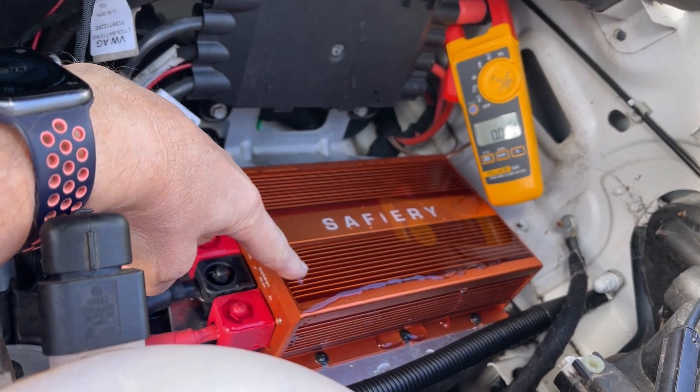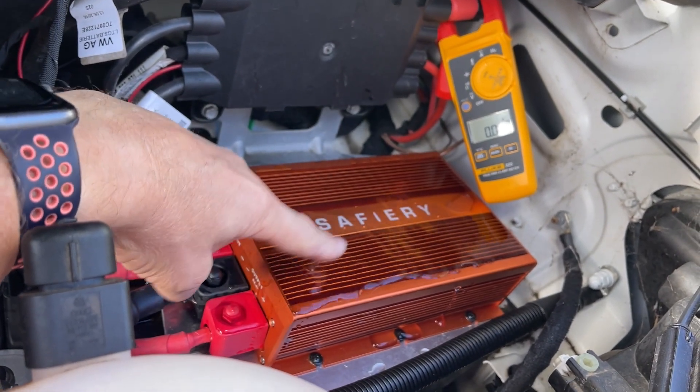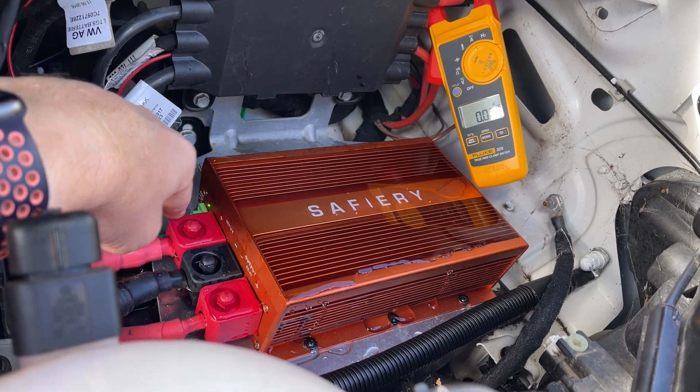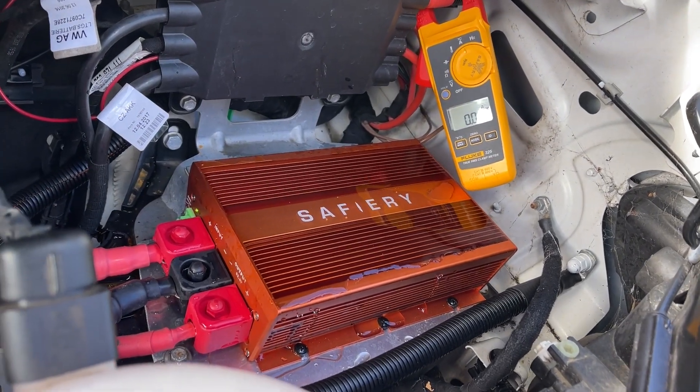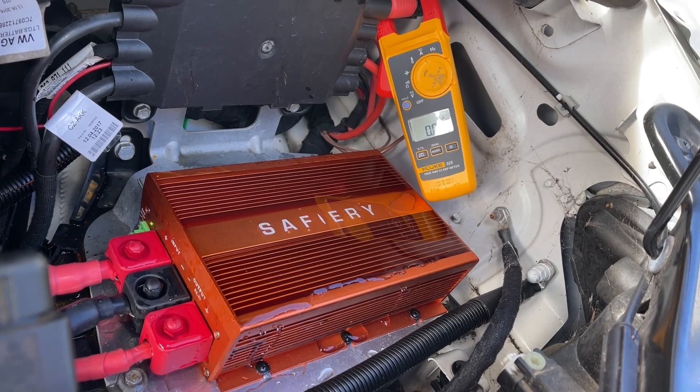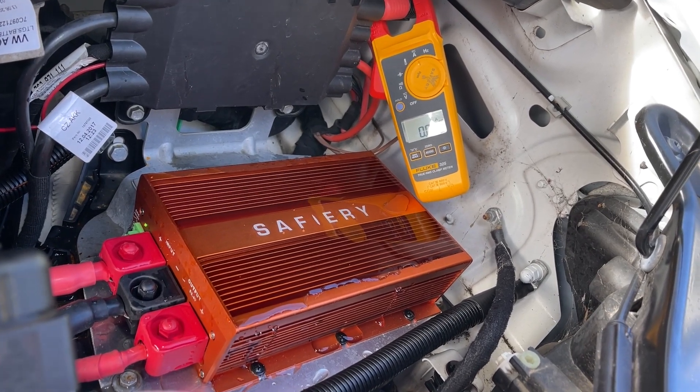The Killer Wasp — just the fundamentals. It's 1,000 watts, 80 amps DC to DC. We've had a lot of rain here in Queensland, it's got water on it. It is totally potted, which means it can actually be submerged, apart from the terminals of course, but even in fresh water they can be submerged.